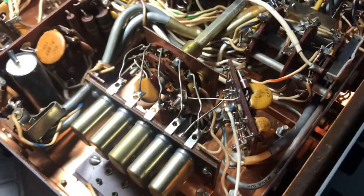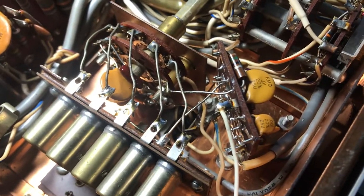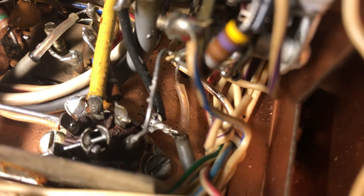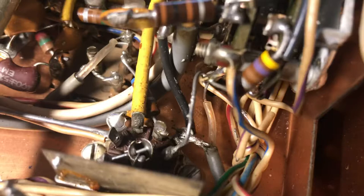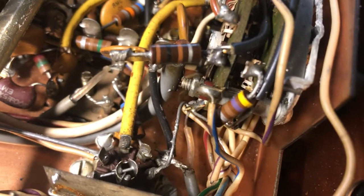These crystals here I found are really clean, so let's look at those. You can take off on those crystals — look for the coax coming out of these assemblies. This one has coax actually leading over to the band switch here. You can see the coax with the little braid that looks kind of clear — that's the coax for that VFO connection. The VFO is kind of a stinker though; it doesn't look like it's working very well.